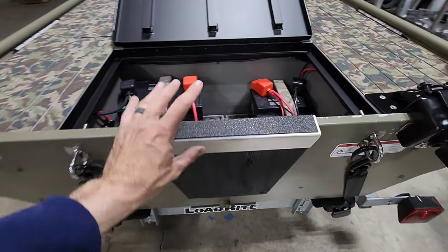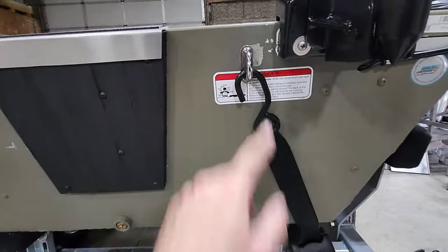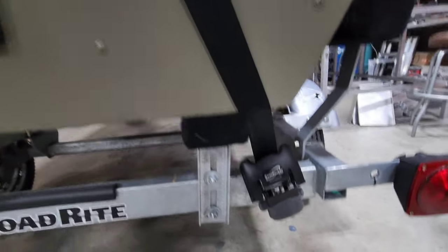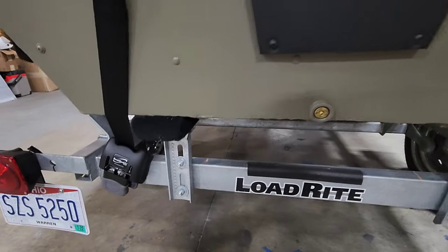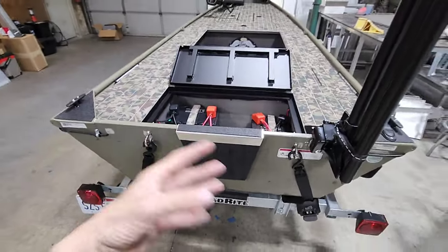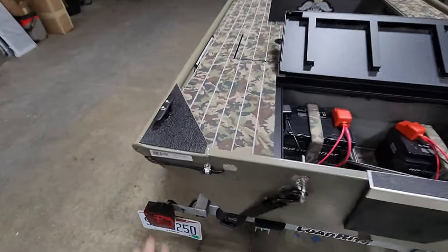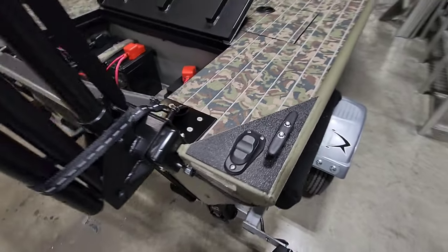On the transom, we re-skinned it. On the motor mount, we added some eye bolts, a retractable boat buckle, and transom straps, and then we adjusted the bunks accordingly — they stuck out a lot further because he got the boat and then got the trailer afterward. Gator skins on the corners, new cleats, and you've got your rear stern light.